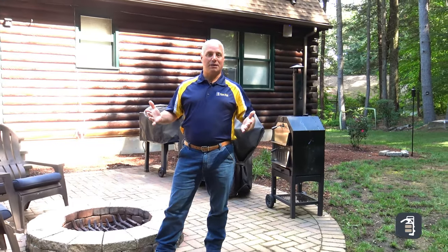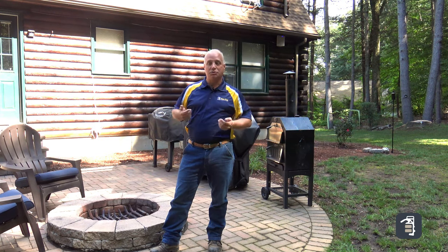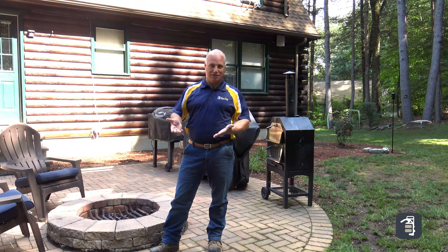I'll give you just a little bit of history about this job. We did this job about 25 years ago for a homeowner — a backyard patio with all kinds of landscaping. Since then, new owners purchased it, a new design was made, and the pavers were getting old and ratty. So we took everything up, redesigned, and the pavers were turned over and used on the opposite side, because the surface of the existing pavers was so worn that flipping them gave it a nice, neat, clean look. This was an opportunity for us to use our hybrid edging.